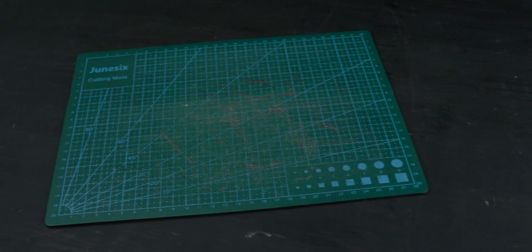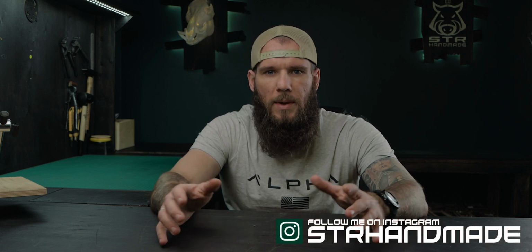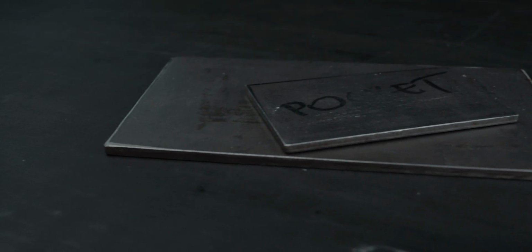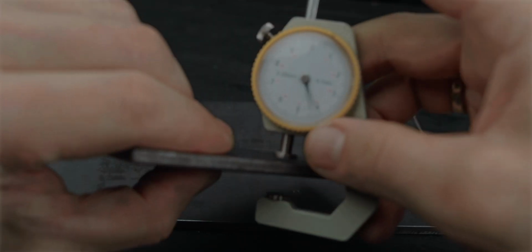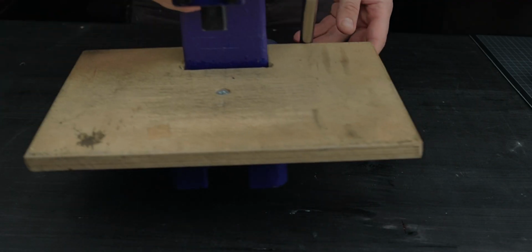To make this cutting press fully working, we also need a couple of things. I use this small self-healing cutting mat, which you can usually see on a leathercrafter's workbench, on my plywood pad, and I made a few 5mm thickness steel plates, which I put on the cutting die to spread the pressing force of the piston. Okay, let's look at how the whole cutting process looks.